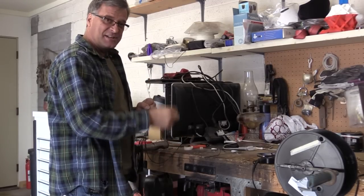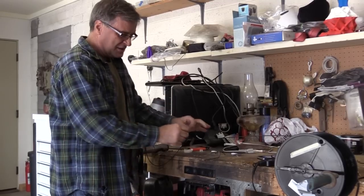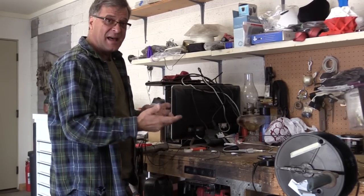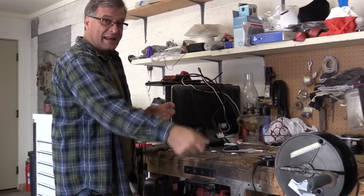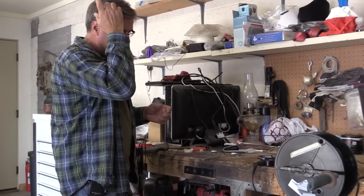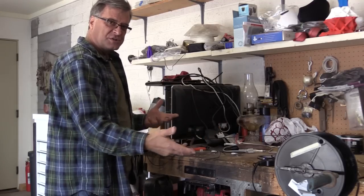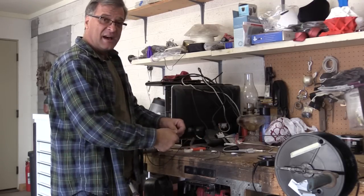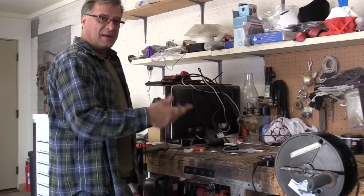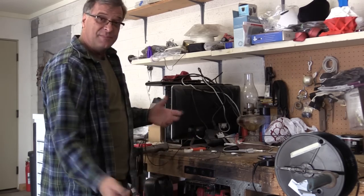So this will check it at three millimeter — it's not sharp enough to cut the bulge off, but it's tight enough to catch that bulge so it'll stop turning, and then I can go back and file it down or cut it out, do whatever I can. The nice thing now is with a partial spool or two partial spools, I can weld them together and make a full spool again, rather than having to get up in the middle of the night to come change it. So let me just kind of feed this through and we'll roll it up.